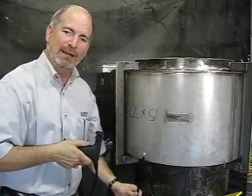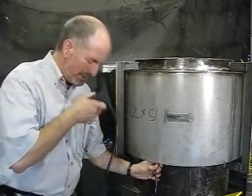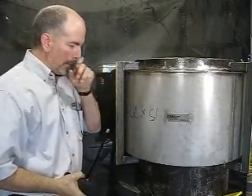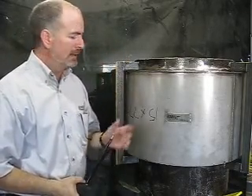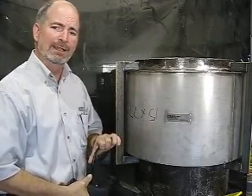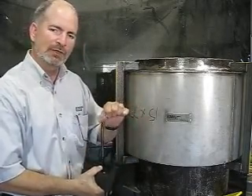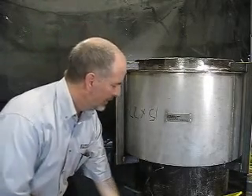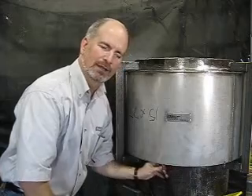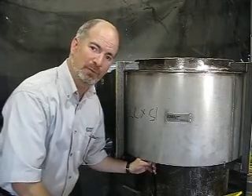You can inspect the bellows and see if you've got any cracks in there. And you're doing this while balancing yourself on a pipe — of course, you've got your safety equipment on and you are properly tied off somewhere. That might be a little bit difficult, and you've got a lot of these things to get to. When we're trying to reverse engineer some parts for power companies, we go in and try to see what we've got. There's also a good way to get a convolution count on the bellows, which is always very helpful. You put as much of a 90-degree bend as you can on the boroscope and sail it all the way in.